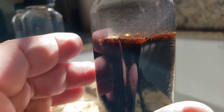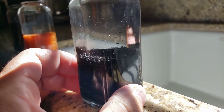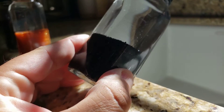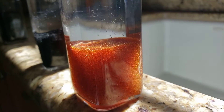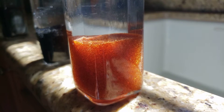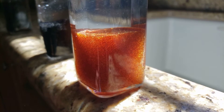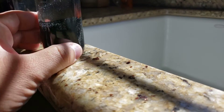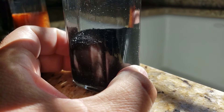The whole point of the Hague WaterMax design is that we want to filter out the chemicals, like chlorine, before it comes in contact with the resin, because the resin itself has a shortened lifespan due to chlorine. So in order for us to achieve our 25-year warranty on our resin, we have to filter out 100% of the chlorine before it even gets to the resin.